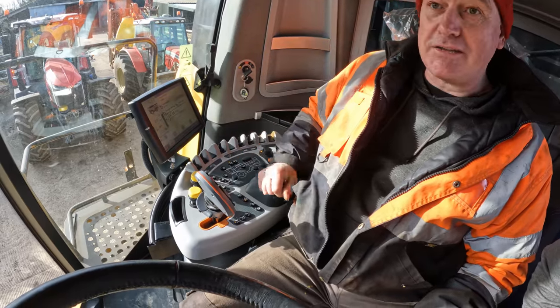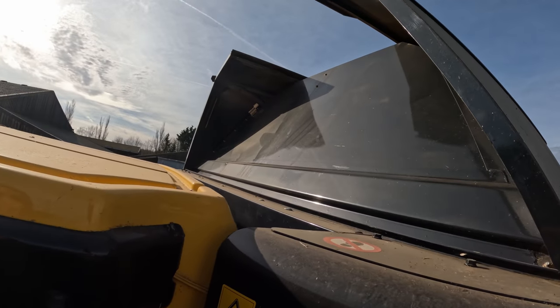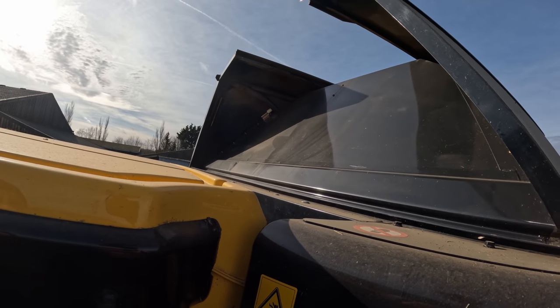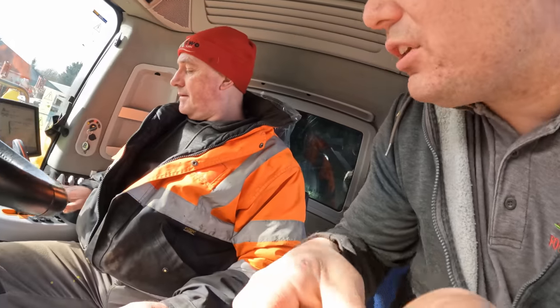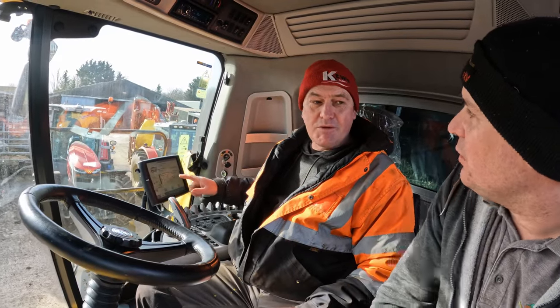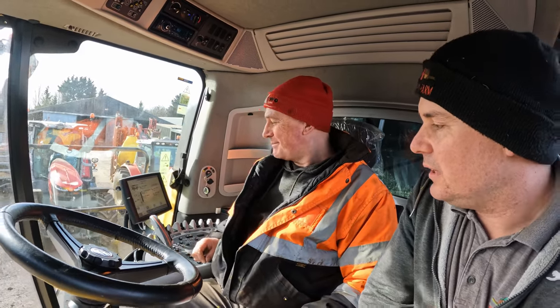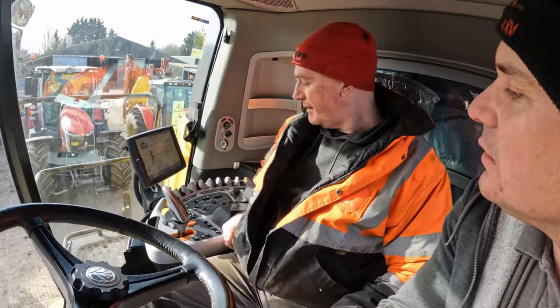This one closes your grain tank lids, so they will be closing now. Have you got to remember to open that before you use it? You have, but a warning comes up on the screen if you don't. It's more important to remember to close it when you're driving into a barn because you'll make a mess with the lids. And if you don't close it going down the road it will tell you. If you don't open it when you start the internals, it will tell you.